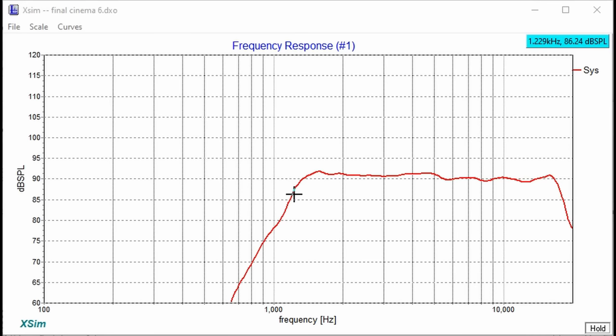By doing that, it allows me to get a sharp angle on the tweeter, which gives us a significantly better distortion profile. All of our distortion is significantly down at the crossover point and further, which is great. It gives us a very clean sounding speaker. It also allows the woofers to cross over sooner. Now, the woofers in general, when they go further over to crossover, two things happen. One, they start beaming, which means that you get a narrowing of the soundstage. And two, they also start having a rising distortion. So if we can cross those over sooner, we can get rid of both those things, once again making a better sounding speaker and a wider soundstage. And guess what? We were able to do that.